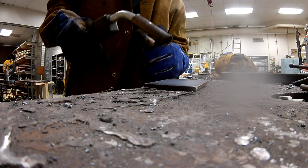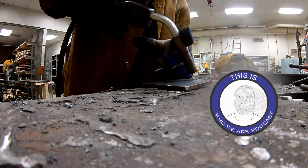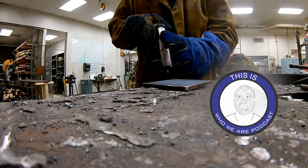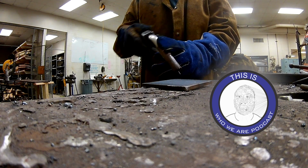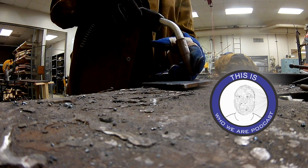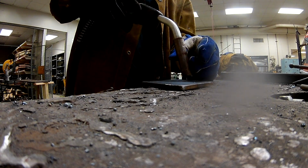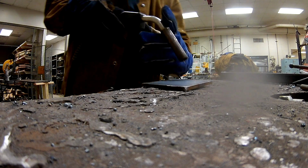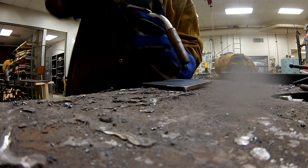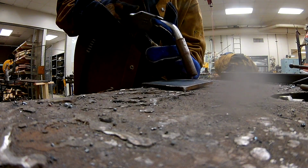So we'll talk about the 4 basic premises of welding. The first thing we're going to look at is travel angle. All right, so I've got about a 10-degree travel angle as I'm dragging. And when I say 10 degrees, I want you to realize if I'm facing you, that's 10 degrees this way. If I'm going this direction, that's going to be my work angle, which we're going to talk about next. So 10-degree travel angle as I'm pulling, and then from vertical I want about 10 degrees this way. And if you notice, the way the MIG gun is shaped, it's designed with that bend in there to make it comfortable so that you don't have to hold your elbow up in an awkward position. So that second one is kind of built in.